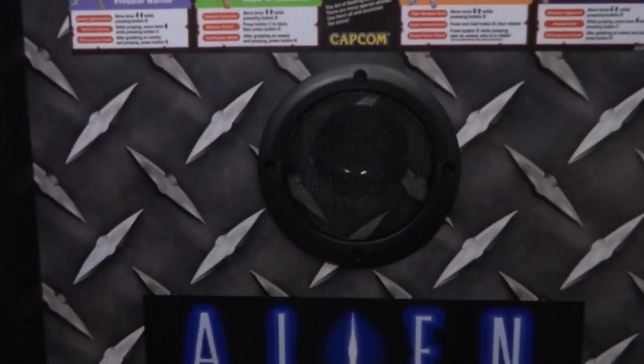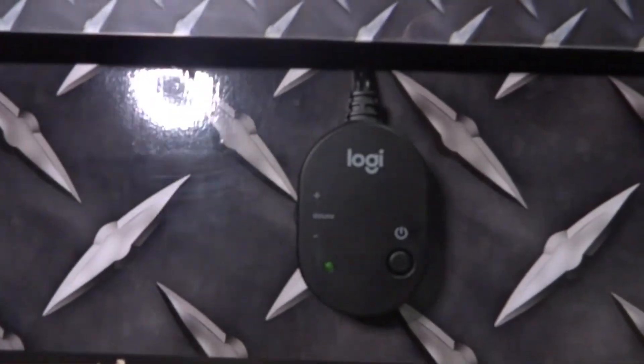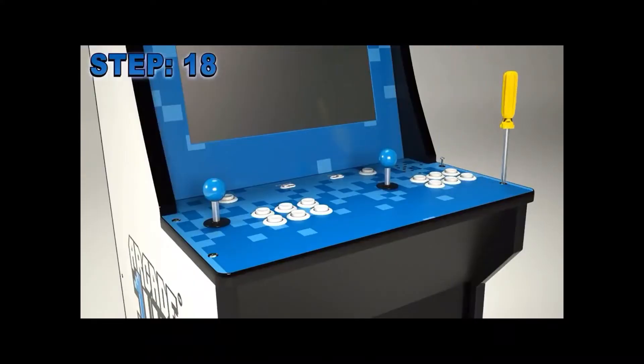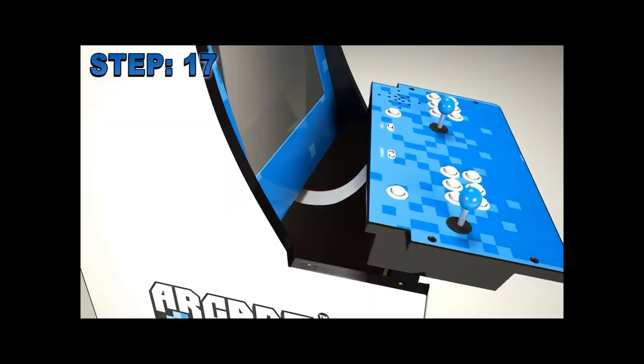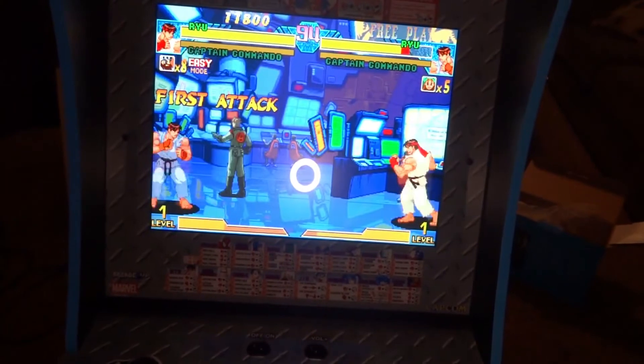On my custom Alien vs. Predator cabinet, I ported the front of the box and covered that with a speaker grill, and I mounted the volume controller to the front as well. I also wanted the ability to plug in headphones for late-night gaming with kids trying to sleep. If you want access to the volume control knob and headphone plug-in, you could take off the control panel, notch the J panel underneath so the wire can pass through, mount the volume control knob to the J panel, then put it all back together — that would make for a clean install.